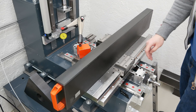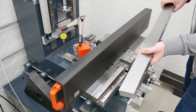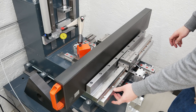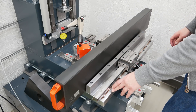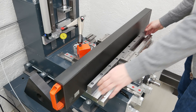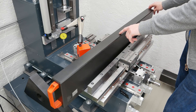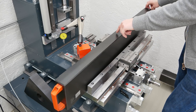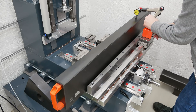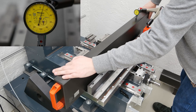The next thing is I will mount some reinforcement here for the lower plate so it is a little bit stiffer, because I made it quite thin to not lose too much Z height. I will use this reinforcement here, but as I noticed the plate is bowed a little bit. You can notice this when I turn the straight edge — the center of rotation is around the middle here — and I can put a dial indicator on one end and see that it moves about eight micrometers when I press down.